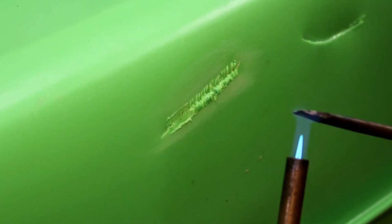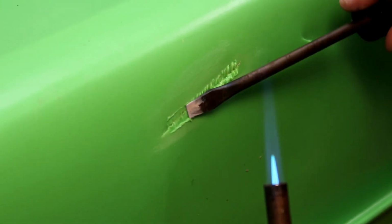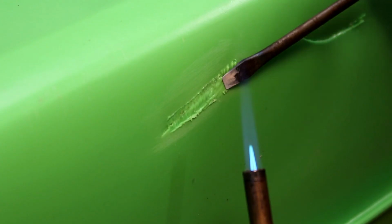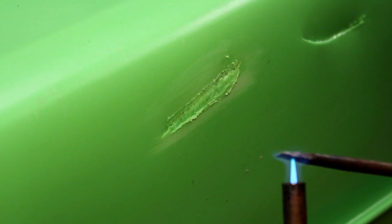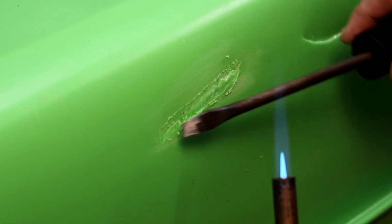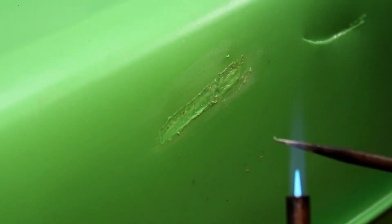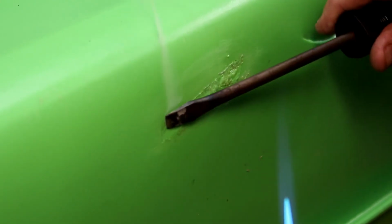The one thing I will suggest to you is we do not recommend, after doing our test now, that you heat up the base material directly using the torch like I did in this video. If too much heat gets applied to that base material, it starts to get really soft and flexible, and it becomes very hard to get it to hold its shape. It likes to distort, and sometimes it'll even pull your seam that you're welding apart as it starts to distort. So try to keep as much heat off of the base material and limit the heat just to the area that you're welding.